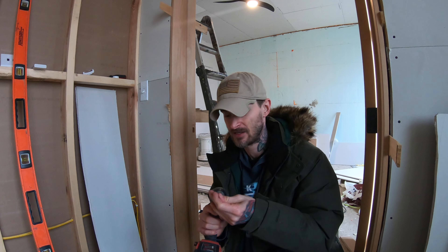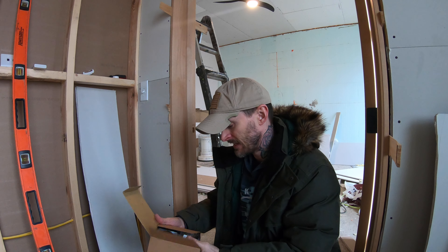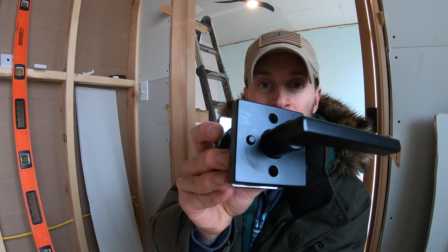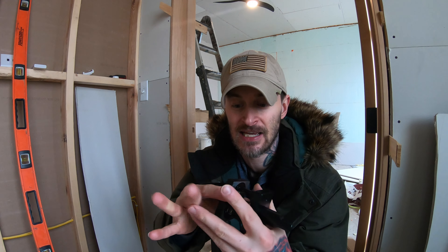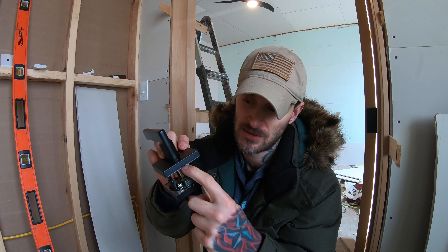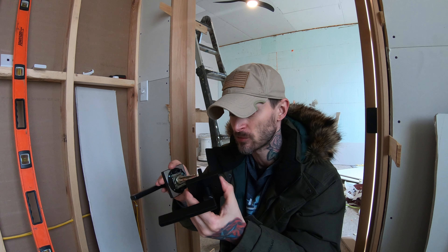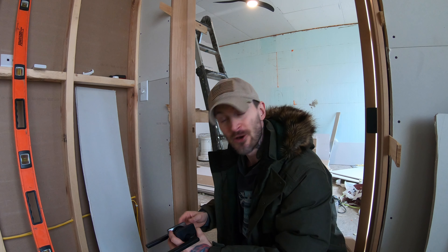All right, before I pass out for today, let's go ahead and get our doorknob on. It's the exact same thing we had last time on the pantry, except this one is a privacy lock. It's pretty nondescript — it looks just like the other one on the pantry, but just this little itty-bitty tiny button right there. You just push that in ever so slightly — just the little 16th of an inch inside click — and then the outside locks. And on this side it looks like there's a pinhole where you have to put something about two inches through to push that open, and then it'll unlock the pin. Let's make sure we can get the door tight and everything shimmed up properly. And then we'll have a bedroom door, finally.